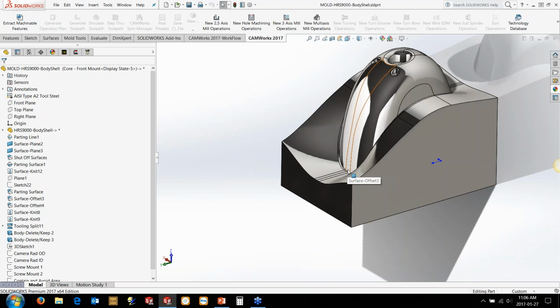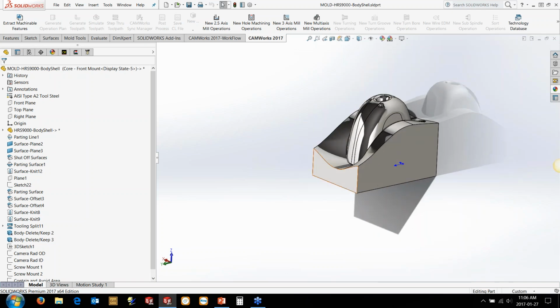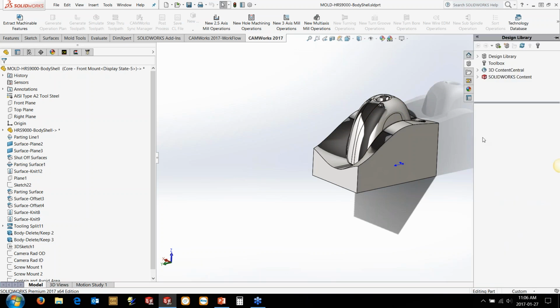So we're going to invoke some of those convert to 3-axis toolpaths. But even just from a starting point, we need to start looking at fixturing things. A lot of times things like dovetail fixtures and dovetail vices are usually one of the ways that a lot of people fixture 5-axis parts just to get access to all different areas. Now, I'm going to show you a little bit about that later on, but the first thing we need to do is maybe do a little stock prep and go in and put in a dovetail.